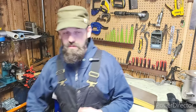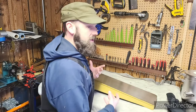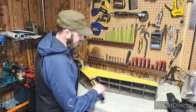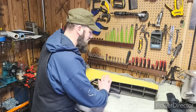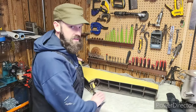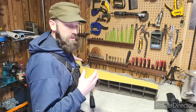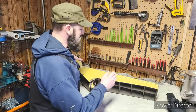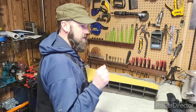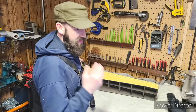Now, how do you identify cast iron? When you look at a part that has a smooth finish like this, simply turn it over. If you look at the side and the bottom of this part, you can see this rough surfacing — that is from the sand from the casting process. That is the easiest way to identify cast iron. Or if the part brought into you is broken in half, simply look at the granular structure. If it's a very bumpy and coarse structure, more than likely that is going to be cast iron.